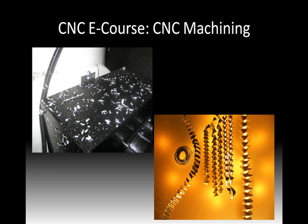Here's a look at some chips. The ones on the left are left over from machining some aluminum, and they fly around — the spindle is going at around 1,000 RPM, and as it's removing material those chips are flying around. On the right you'll see what's left over from drilling. What I'm pointing out is that those are sharp. You don't just reach in and grab chips or remove them with your bare hands — there's a cutting hazard as well.